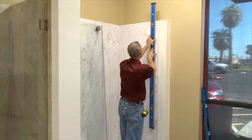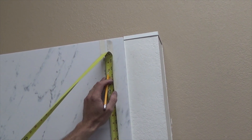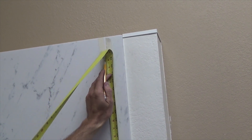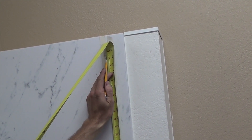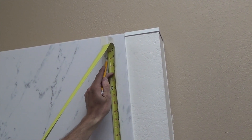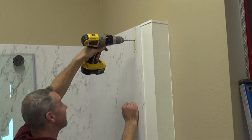Due to the extremely smooth nature of the rollers, the header support bar must be installed level. Failure to do so could result in the sliding door rolling to one side by itself. Drill the holes and mount the track holder fitting blocks to each side wall.